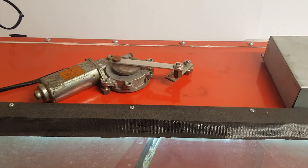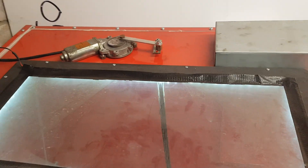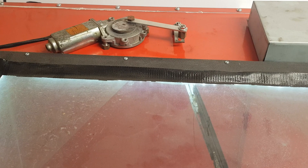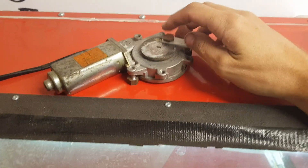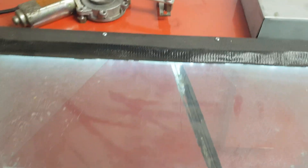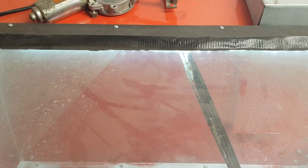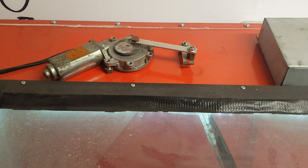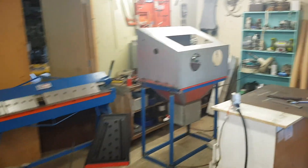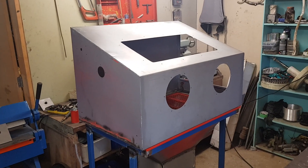It's just a vehicle wiper that's been cut down and made to fit. If I just hit the switch there — really simple, it's got no limit switches, nothing on it. It's a nice cheap easy way of setting them up, and the reason I like to do them this way is because I can set the throw on them. Like a boat wiper tends to have a set sweep angle, whereas with this one I can set up whatever angle I want. This one's a bit of an ugly one but when I do one for this cabinet I will show the process of building and setting it up.